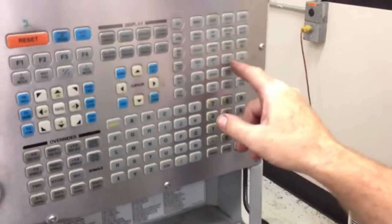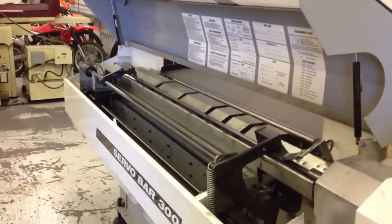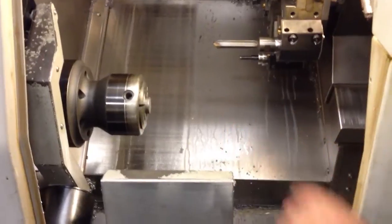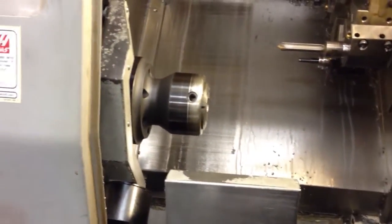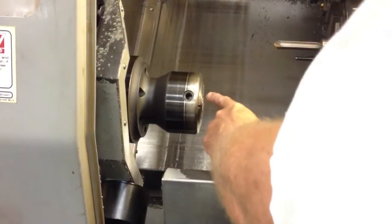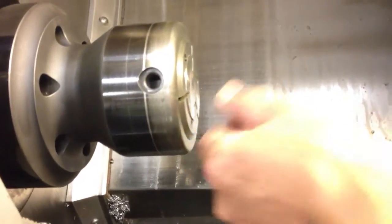Then you go hand jog, select hole fast, and you come over to the spindle — you dial it, you bring in the handle, take a look at the bar feeder. See how it's coming towards me as I'm dialing it in. And then back to the collet over here so you can see. See how it came through the collet? You just dial it back a little bit, push it back, step on the pedal. And you want flush with the face. Dial it back just a little, push it in. Now we're flush with the face right there.